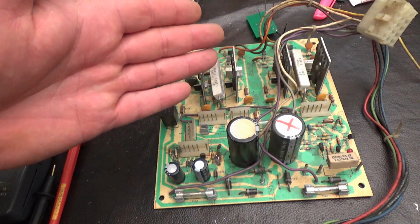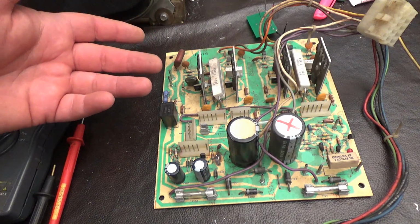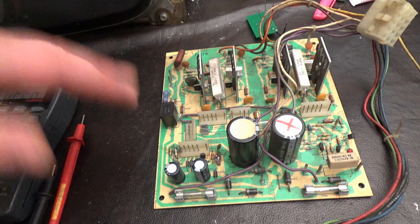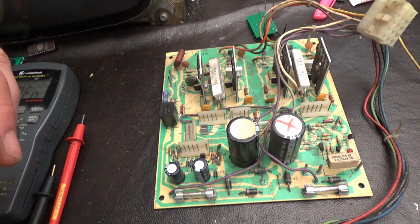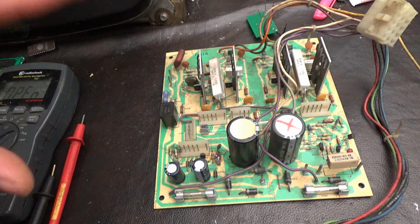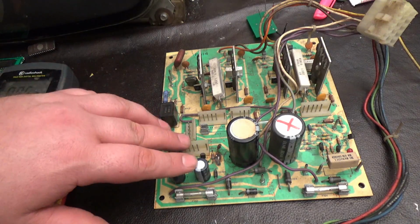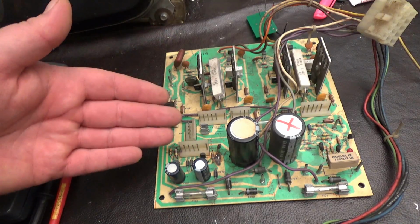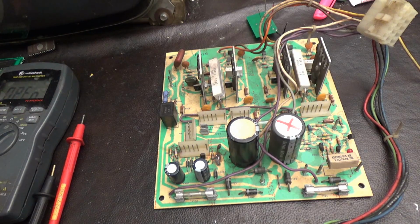you have a refrigerator connected to the same circuit. Well, every once in a while the compressor is going to turn on, and it will drop the voltage in that circuit in your house, let's say 5%. Have you ever seen this on a TV set? Something with a large, especially inductive load will turn on, and it'll dim your TV for a second, or dim the lights for a second, or whatever. This is meant to actually regulate the voltage and give a little more, so let's say if it regulates it to 27 volts, but you have 28 available, you can still have 27 volts. Does that make sense? I hope it made sense.